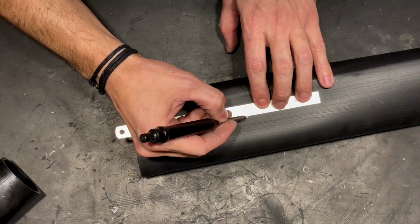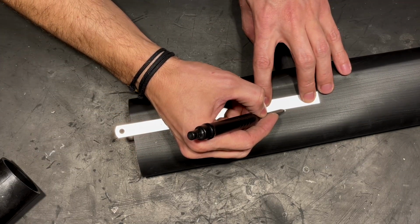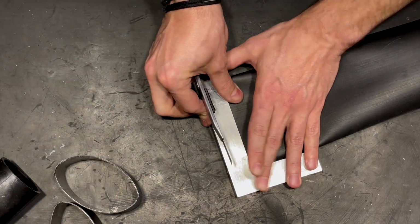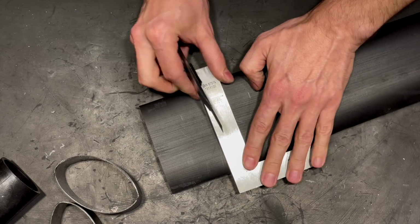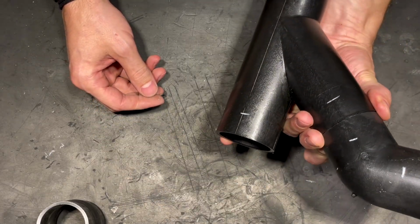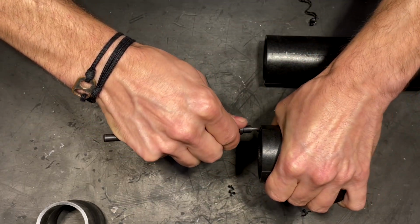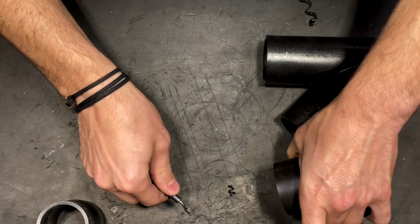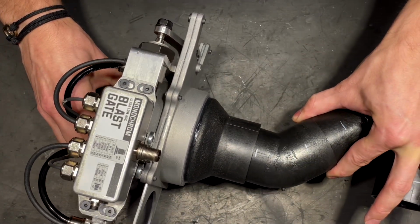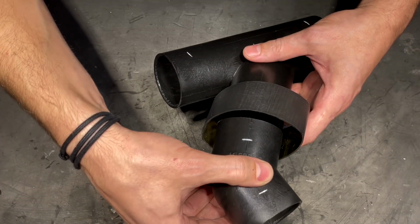This is large diameter glue-coated heat shrink tube. I use sleeves of that tube to connect the individual pipe elements of my vacuum piping. The pipes I use are actually drain pipes, like waste pipes. They are normally welded together with what I think is called a welding mirror. You heat up both ends and you just put them together when they're molten.